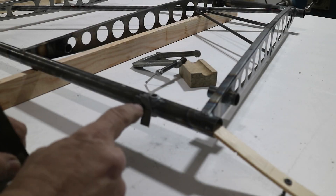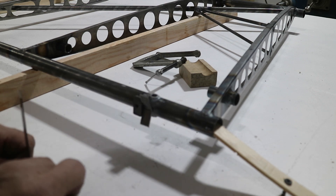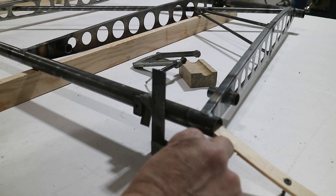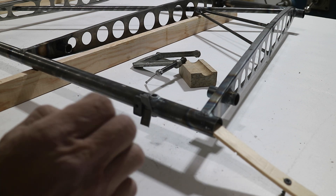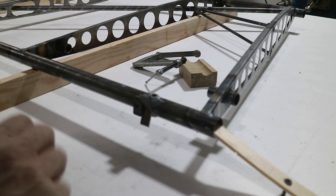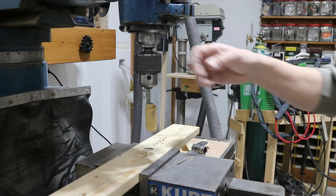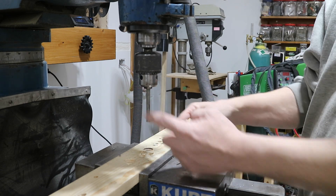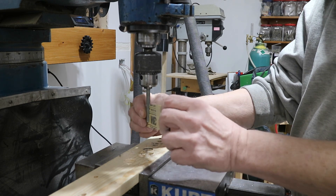The last little thing for the hinges is this little support bracket. I blanked out some steel, bent it, then just matched the plans and used a square to get it straight up and down. I eyeballed it from the end — I've got a magnet on it holding it in place. I'll get a little tack on it, tap it around if I need to move it, then weld it in place and grind it to fit. This is my rig for cleaning up the bore on these hinges — it's just a shaft, a piece of steel I split and put some sandpaper in.